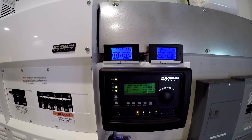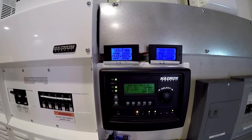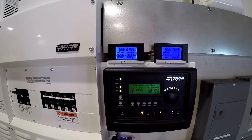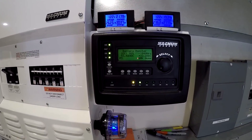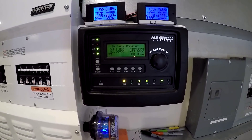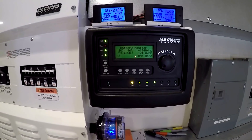Running the base loads, two air conditioners, pool pump, and the water heater's kicking on and off. We've done a couple of showers, run the laundry, and we're going to keep that going. We're at 86% charge with positive 22 amps going into the batteries right now.